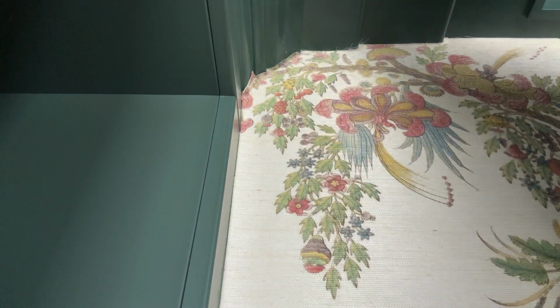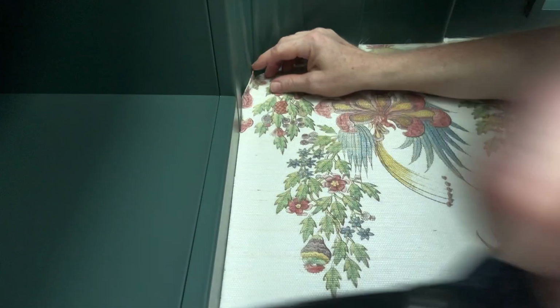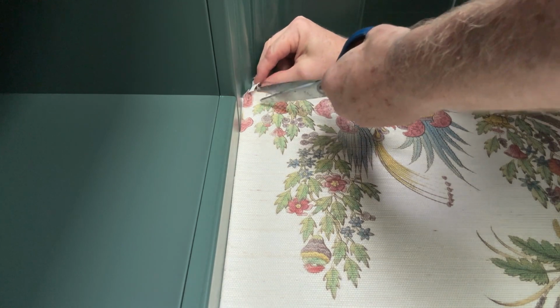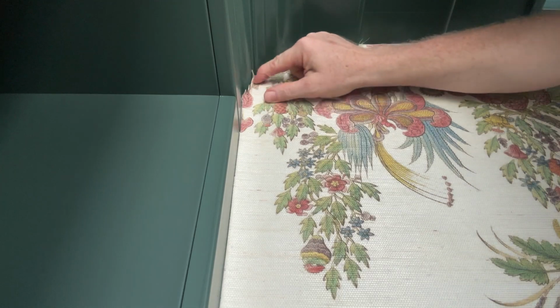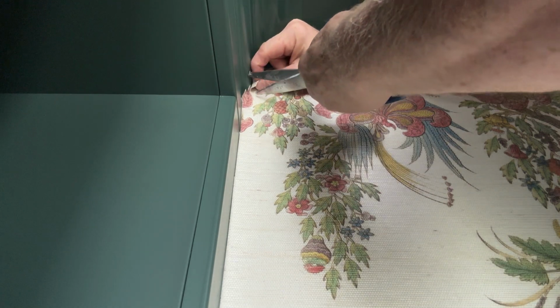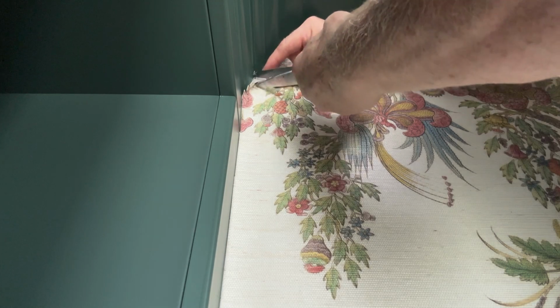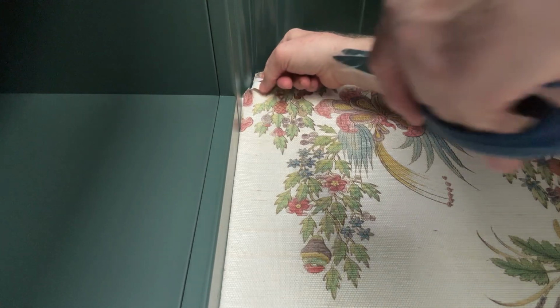You see, when you're cutting on a curvature, your line changes. You might think you're cutting it straight, while you're forgetting that you didn't take into account the angle change, and then you cut it short. That's why these stress relieving cuts that I'm doing right here are very important. It'll make your wall covering conform truly against the real cut line, instead of you imagining the cut line. Okay? Does that make sense?